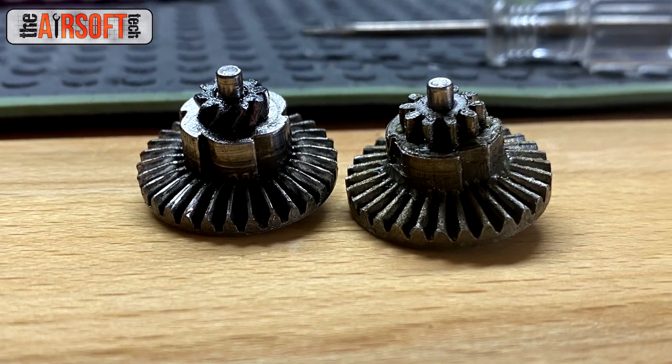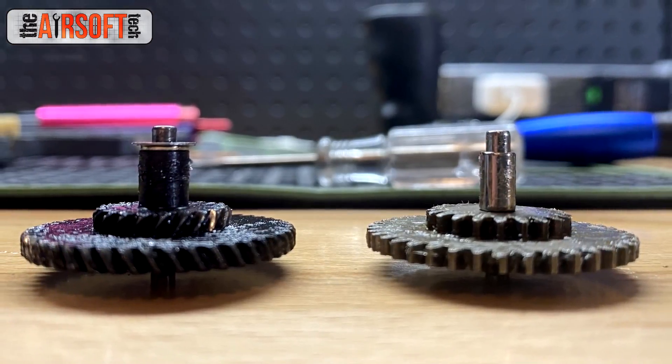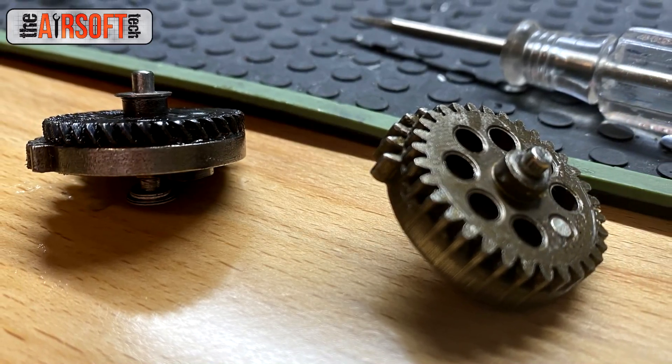So what are helical gears? Helical gears are gears that have a less than 90 degree angled cut and mesh with each other over straight gears. This angle allows the helical gears to make more contact with each other than regular straight cut gears, allowing for a smoother and quieter action under normal circumstances.